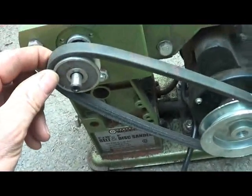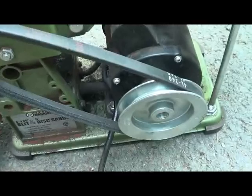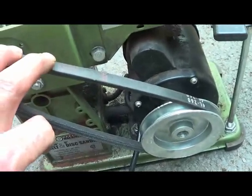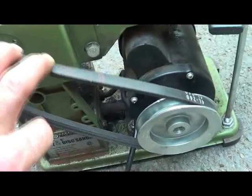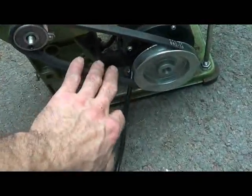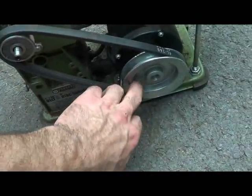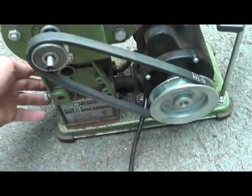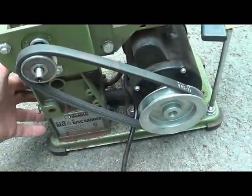This is the original pulley up here. If I turn this on, originally it was running around eleven hundred feet per minute belt speed. With the new pulley at four inches versus one and a half, it's almost three to four times faster. It has a little trouble getting started but once it's going it seems to have plenty of power. I'll give you a quick demo.